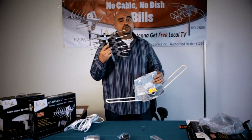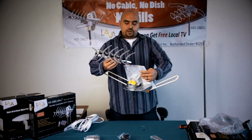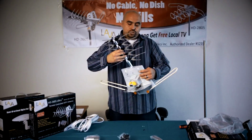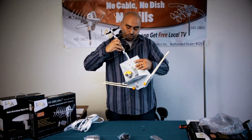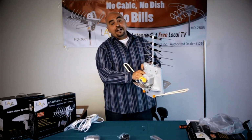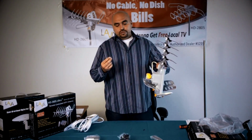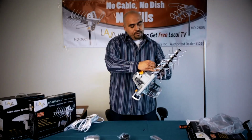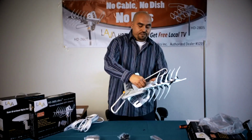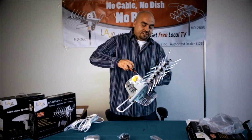Make sure that the butterfly screws are facing down at the same side as the motor rotor is. Go ahead, you'll notice that there is a slot in the front of the main unit. So what you do is slide the aluminum square pipe into the slot, like so. And using the final screw, which is the 4x18 screw, you're going to use this screw to attach and secure the aluminum square pipe. From the bottom of the main unit, you'll install the Phillips screw in there. And simply thread it in there until it's nice and tight.